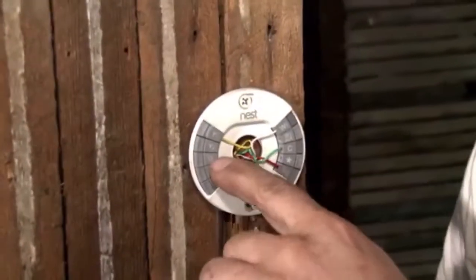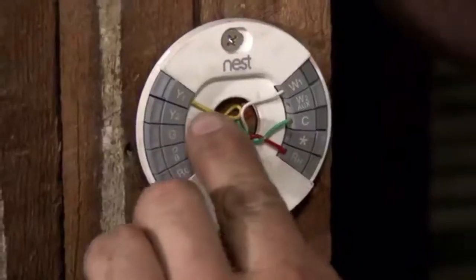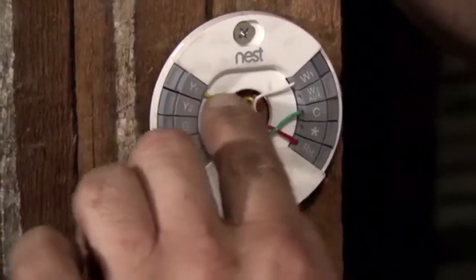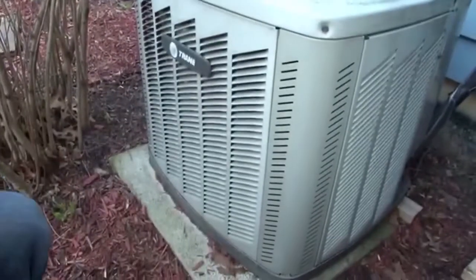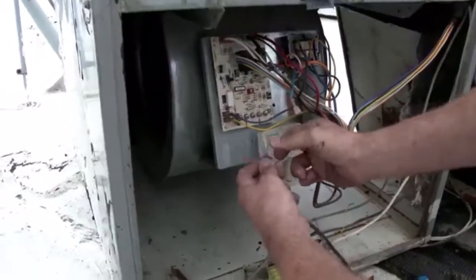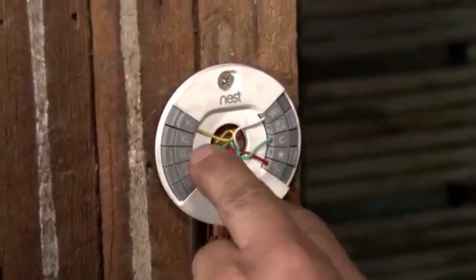The reason you don't need the green wire is that terminal is used when the thermostat has to control the fan separately, which is only about one to two percent of systems — older systems with separate fan control, not common nowadays. If you have a newer home built in the last 20 years, you're in that 99 percentile. On a modern system, when the Y1 terminal — the cooling output — gets a signal, the thermostat closes the circuit between the yellow and red wire, and the control board has built-in fan logic. Once it gets a signal, it turns on the condenser outside and runs the fan timer built into the control.